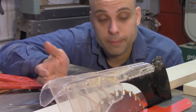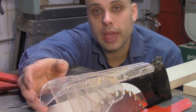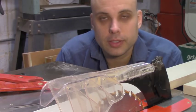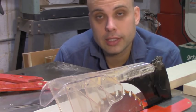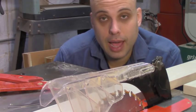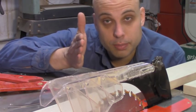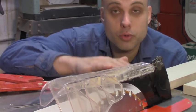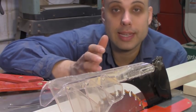These are the sort of things you should think about on your own. Another problem with this blade guard is that even though it's a decent design, these paddles over here get very clogged with fine sawdust, and this shroud over here gets fairly clogged with dust too, making it pretty difficult to see exactly what you're doing. When you're making a rip cut, you set it up, put the guard down, and make your cuts — but since I'm doing very precise cabinet work, I really like to watch the blade go through the cut, make sure it's tracking my line. You can learn a lot by watching the blade — if your cut line is moving back and forth, that usually means the piece against the fence isn't as flat or straight as it could be, and the wood is moving side to side. That's going to let you know your piece isn't as square and straight as you want it to be.